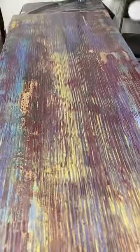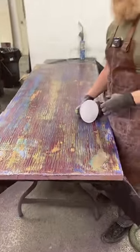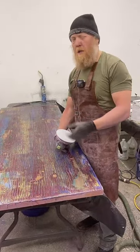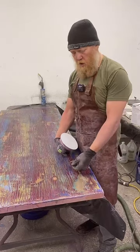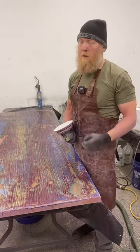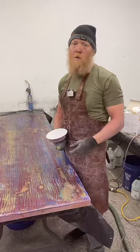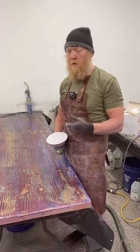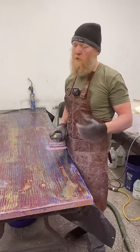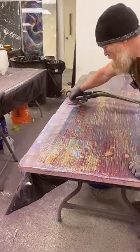We'll see what we get out of 2000 now. I wiped it down. The reason I wiped it down so well is I don't want any of those old lower grit sanding particles swirling around. Now I'm getting to 2000. That's a pretty fine grit. And you want to really clean as you step up in grits, because those chunks sit there and you'll just keep pushing around them, creating more and more swirls. The polishing effect with that large swirl really accents that piece of sand swirling around on there. So sometimes if you can't get a really good polish, just clean better and don't contaminate your sanding discs. And a lot of times your hands will feel things that you never saw. So now this is 2000.